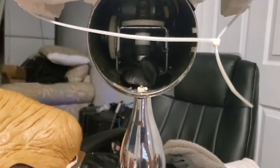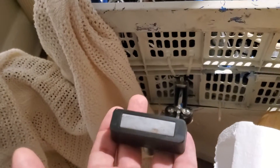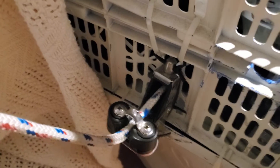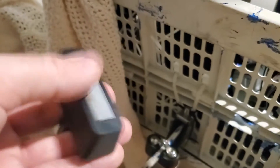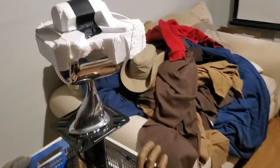That's how I get ET to move, but he also has a neck extension, and the neck extension is a mechanical gas shock. The gas shock is located right inside this seat post right here - it's about a 30-pound gas shock and it's hooked to a pulley system that connects to the outside of the basket. It's always a bit clunky to get his neck to extend because I have to release this - it's a sailboat cleat to hold the rope in place - but I can release it by pulling up on here, which is actually an outboard motor part. If I pull it, ET's neck extends, which is neat, however I wanted it to be more electronic.